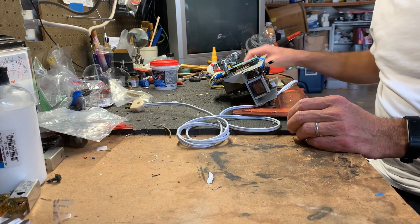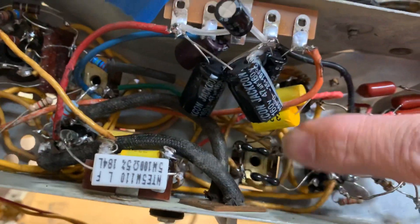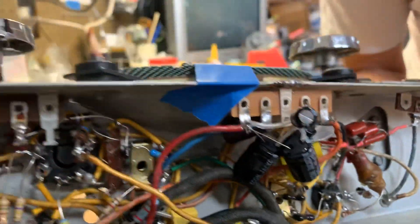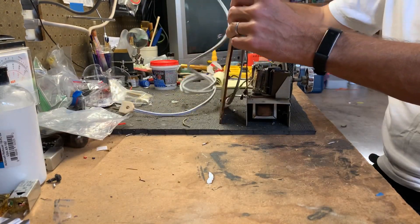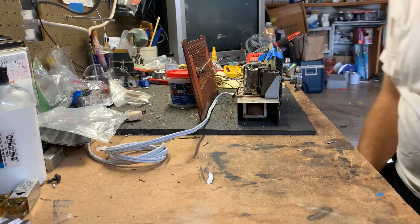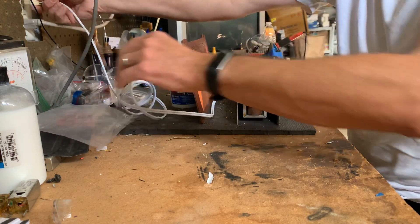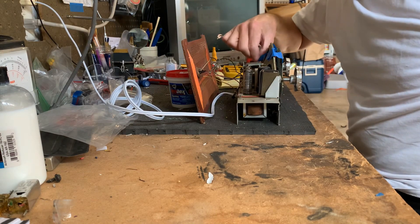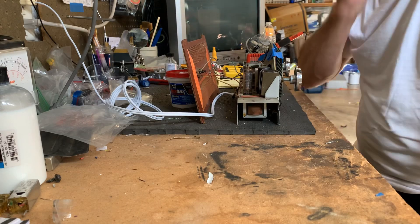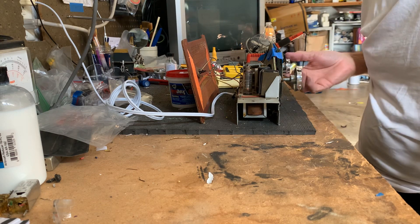Okay, that was fun. Theoretically, it should work. You can see the two new capacitors connected to the underside of that can. I've done the continuity test and I've still got continuity. I'll get this thing untangled — my antenna and my power cord — and we're going to plug it in and see what happens. I'll switch off my soldering iron and my overhead light to avoid interference. Let's see if anything happens here. I refuse to call it — oh, there you go.